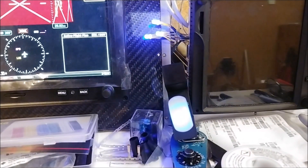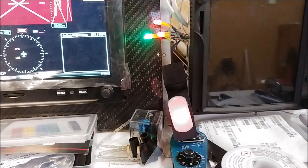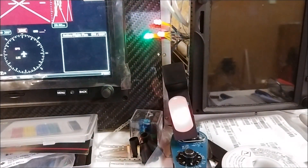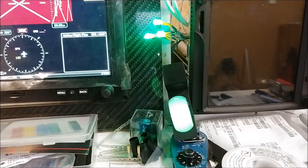Basically, if the gear is all up you get three blue lights. If any gear is in motion, stopped, or not fully locked, you get red and flashing red lights. When they're all down you get three greens, and the gear handle also goes green — quite a bit of redundancy so you always know what's going on. If one LED goes out you've still got the handle. Anyway, that's all wired up now and you'll see more of that later.